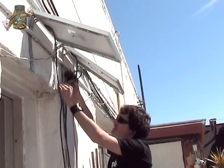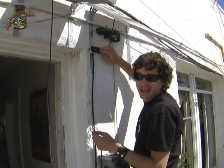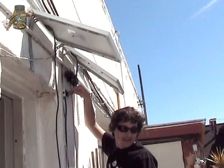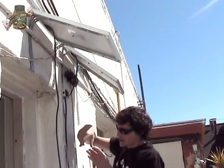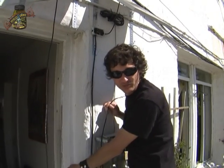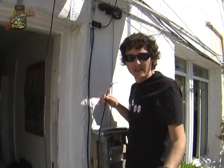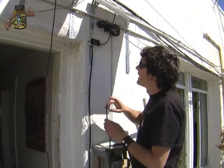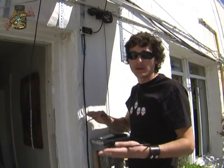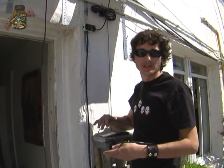Positive to positive, negative to negative — this little combiner box takes those two wires down to a single positive and the two negative wires down to a single negative. Then this runs down the side of our house into an old cable TV junction box. We basically just pulled that cable out, traced this thing where that cable ran, and from there it connects to our battery bank. I'm going to go ahead and get the rest of this stuff hooked up. If you have any questions, hit our website and forums and we can walk you through how to do this. Everybody's situation is going to be different, but I'm sure you can figure out something that will work for you.